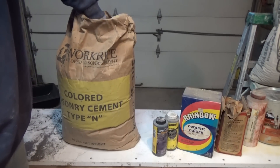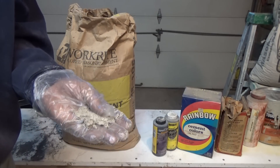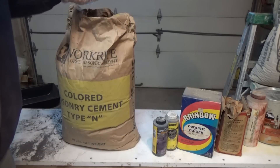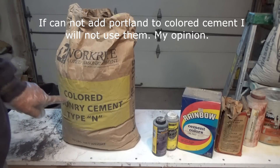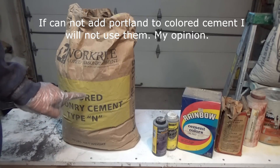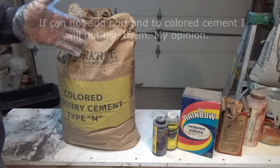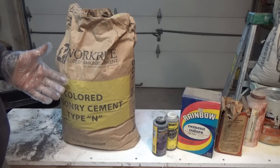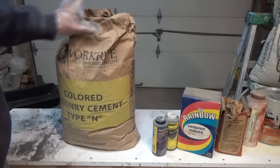We have another cement here — it's a colored cement too, like a buff cement. The point is, if you're going to do brick work or something, you could always go buy a colored cement in this form. You just mix it with your sand, two to one. Sometimes, like with stucco, you can get it all mixed in one and just use it.